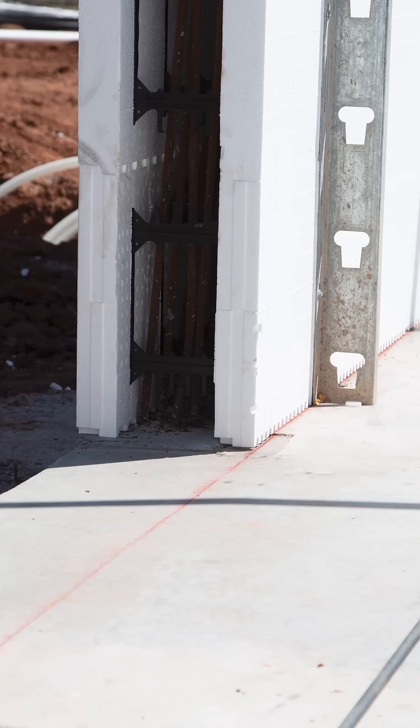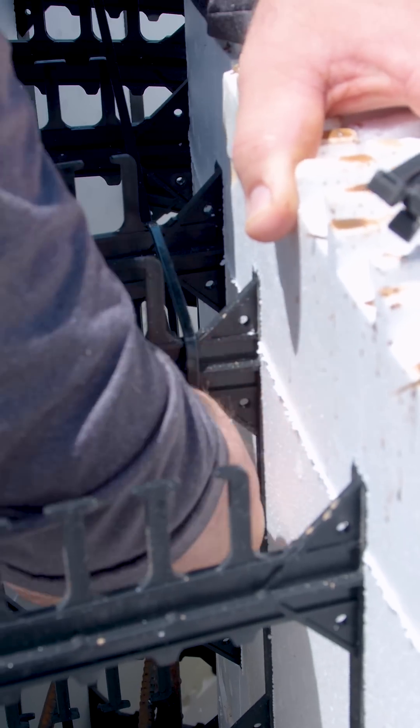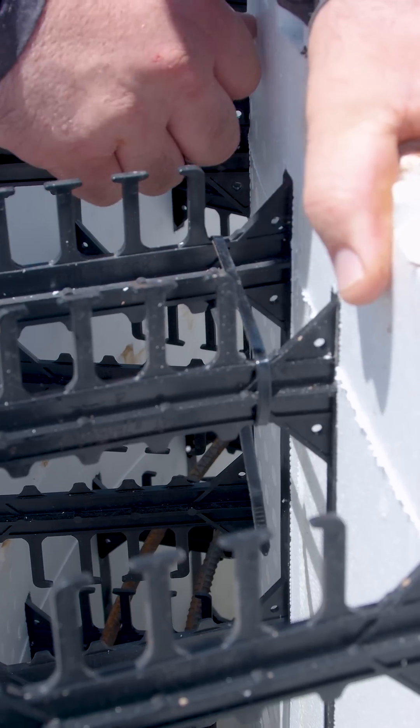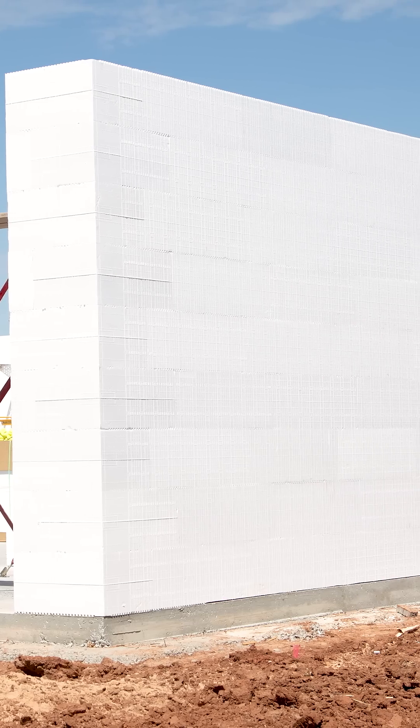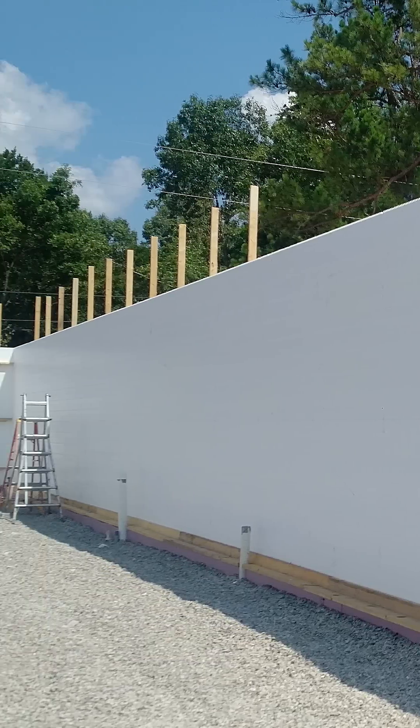Sometimes whenever we're back on the footing and we're dimensioning out, I'll keep some clips or some long zip ties — because if it's a windy day on an Oklahoma slab and they're moving around, once you put a couple of these together before you start to stack and lock them together where they've got some mass, they'll want to move around on you. So whenever you clip them together horizontally, that'll help as you're moving along that wall.